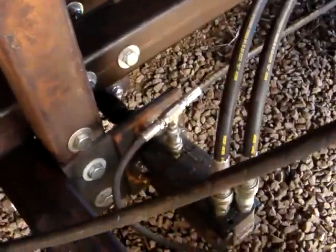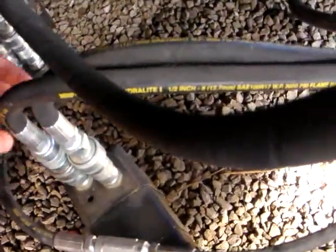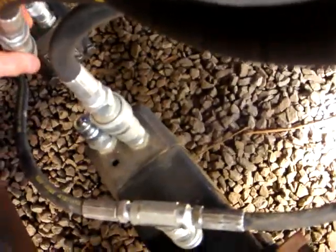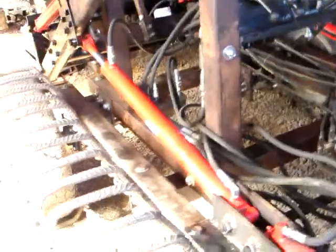It's powered by hydraulics off the power cube at the back. The hydraulics are on quick-attach plates, so if one motor busts, you simply unbolt two bolts — this one and one on the other side of the coupler — the motor comes off, quick couplers here, simply unplug and change the motor in case of it breaking.